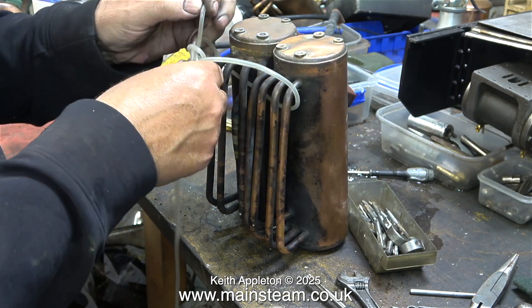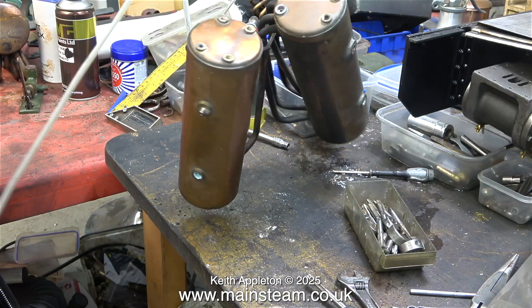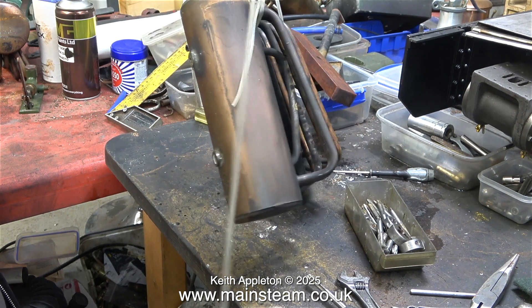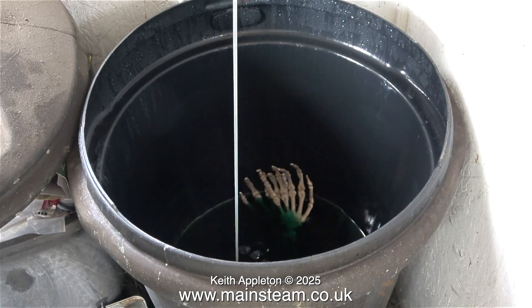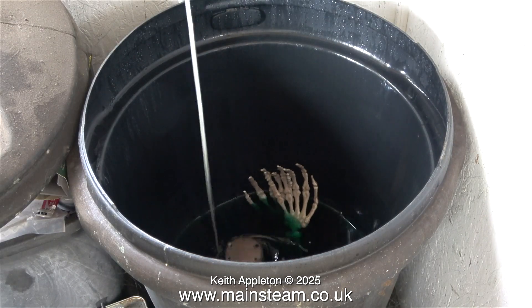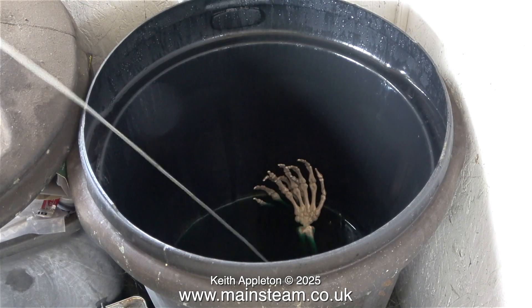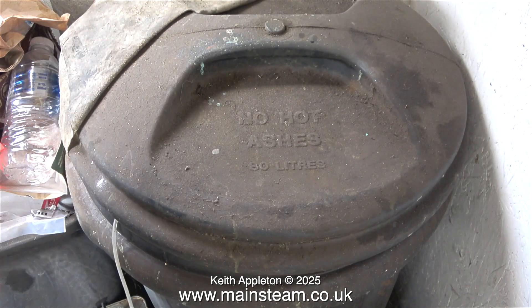What I'm doing here is tying the boilers together using some silicone rubber tubing, because I'm going to dangle them in the acid bath. Here I'm just testing the tied joint and everything's okay. In the outer part of the workshop, I carefully lower the boilers into the acid. The acid in this acid bath is not very strong — it's actually Kilrock K Kettle Descaler, and it's taking a very long time to dissolve the deposits. I replaced the lid on the plastic dustbin and went back into the main workshop.